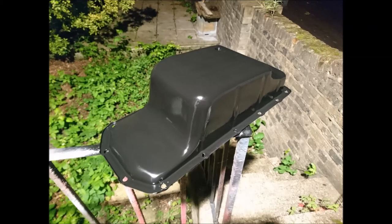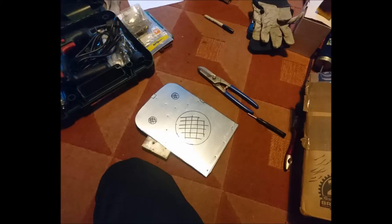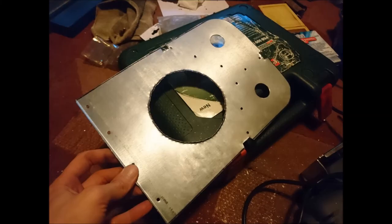This is an idea of what one of the templates looks like — a simple piece of paper just to make sure everything is where it needs to be. The top plate, or baffle, or windage part, is thin sheet metal. The rest is made from slightly thicker sheet metal. I marked it up as needed, drilled a hole through it, then cut that out with a jigsaw. I cut an X in with the jigsaw, the veins were cut out using metal shears, and then using metal fatigue and a pair of vice grips, very carefully worked them backwards and forwards.